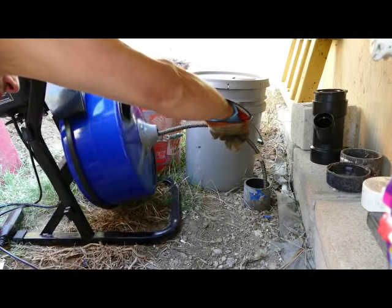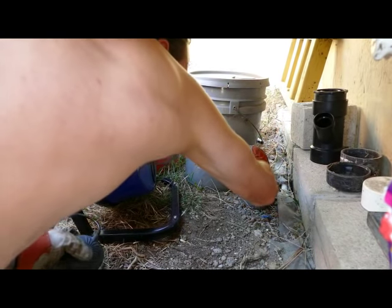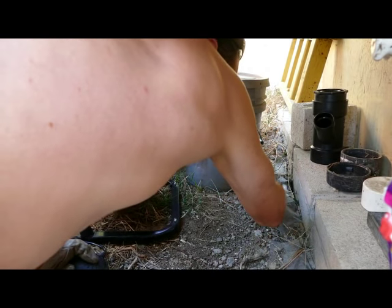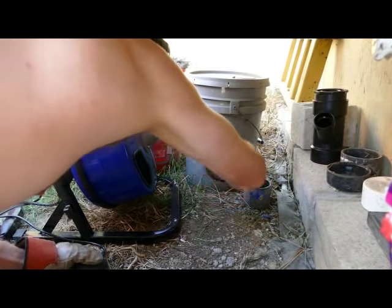The drain pipe can also be accessed by the vent pipe on the roof, but that's also a lot of work. In my case, the clog was caused by a baseball that was accidentally put down the vent pipe. It went through the ABS and then once it hit the cast iron, it stopped. If I had known that, I would have started with the retrieval tool to pull it back out.